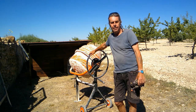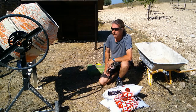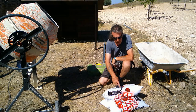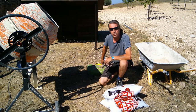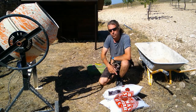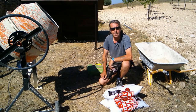It's just getting hotter by the minute, so we want to try and get these posts in at least. We've got our mixer and I'm doing a four-to-one mix — two bags of sand and gravel with half a bag of cement. We're going to stand the posts in the holes, wedge them in place with some big stones, pour the dry mix in when we're happy it's all set where we want it, then simply pour water on it. By tomorrow that should be rock hard. Let's crack on.